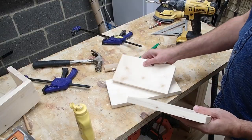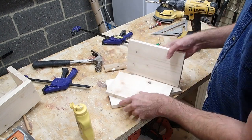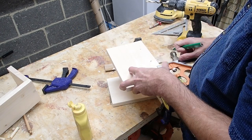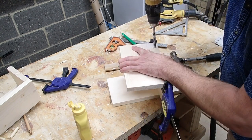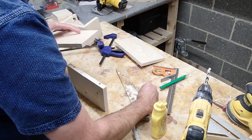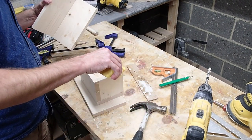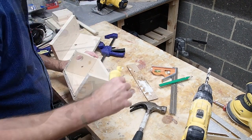Again, using a flat piece of scrap, put the narrow piece on the bottom and the wider piece on top and secure it for a bit. Mark the edge of the wood — I should have done that earlier — so I'll balance that and drill it out. Then apply some glue on the edges.